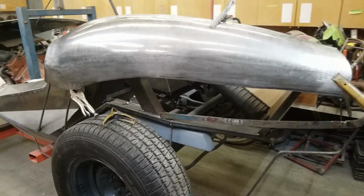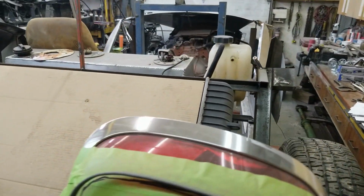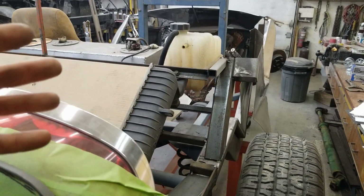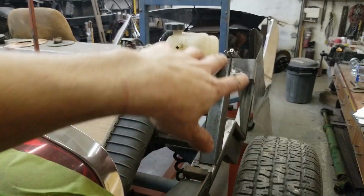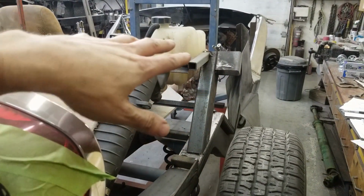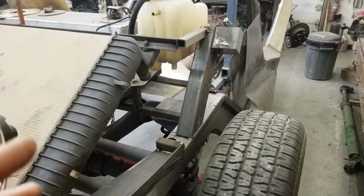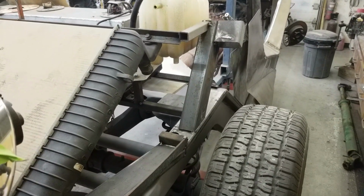And well, as you can see, right now, there's not much over here. So we have to actually build up to it. Well, the door side's been completed. We'll build up the wheel well, get that wrapped up, and then we can go ahead and attach the quarter panel to that. And we'll make sure that all the datum points line up from side to side.